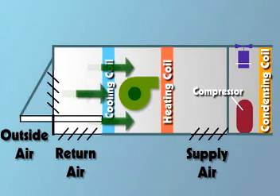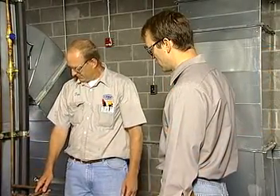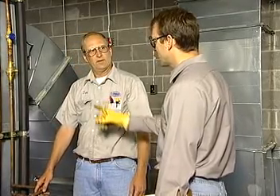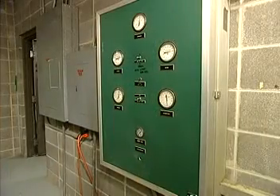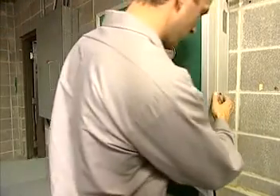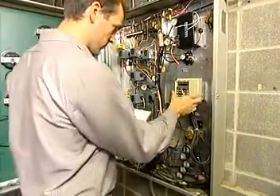Setting the right cold air supply temperature helps manage the fan power properly. A qualified HVAC contractor can help develop the temperature reset schedules and program them into the system. If the building doesn't have a programmable system, then the maintenance staff should be trained to check the reset schedules and make manual changes to the system as needed.